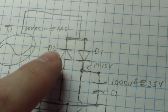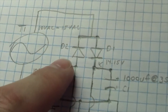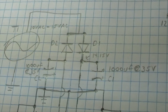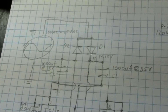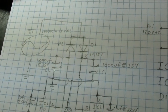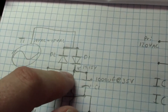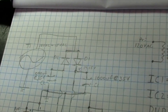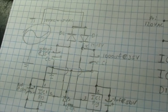What you've got are two diodes. In my design I'm using a 1N4004 — it's just a good all-around general rectification diode. You can really use whatever you want, but I just really like the 1N4004s because I've always got them in stock. For those that don't know: a diode works like a check valve — it only lets voltage flow one way and won't flow backwards if the polarity changes.